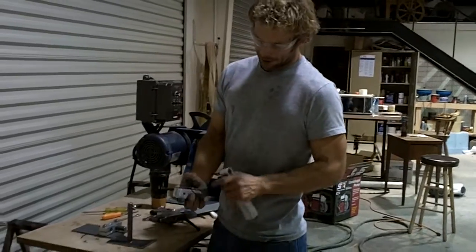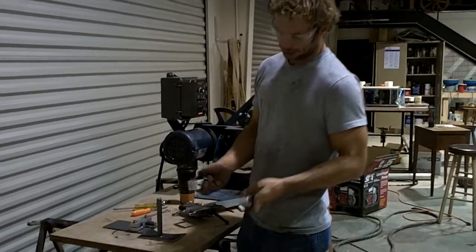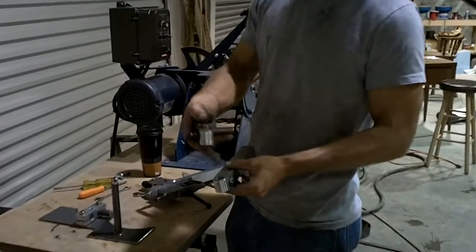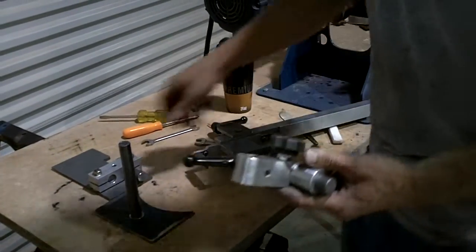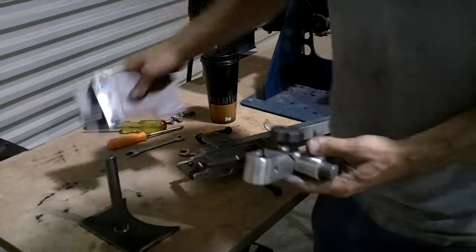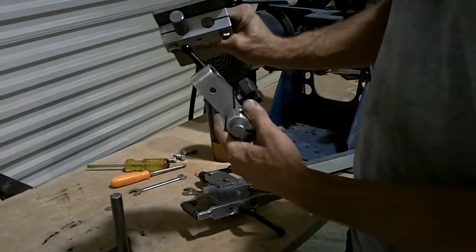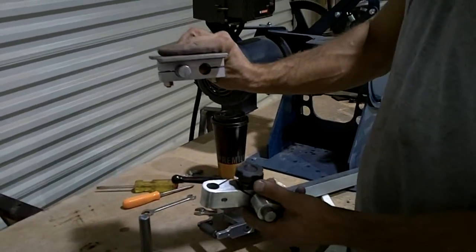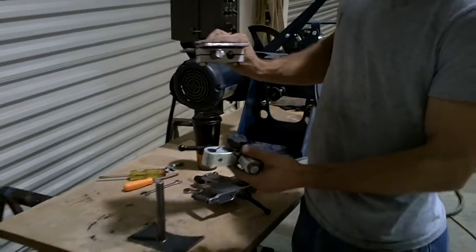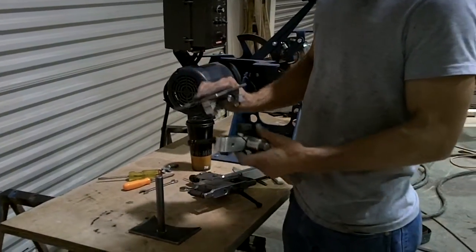So your second block is this 90 block, the two holes at 90 degrees. With the combination of being able to orient the hole up, sideways, this way, this way, however you want to go, and then combined with the table, the first table is this little guy here with two holes, that allows you to position the notch closer or further away from the grinding surface on the platen, contact wheel, small wheel, etc.